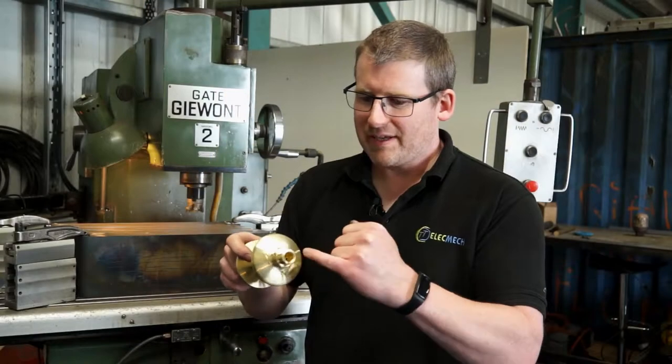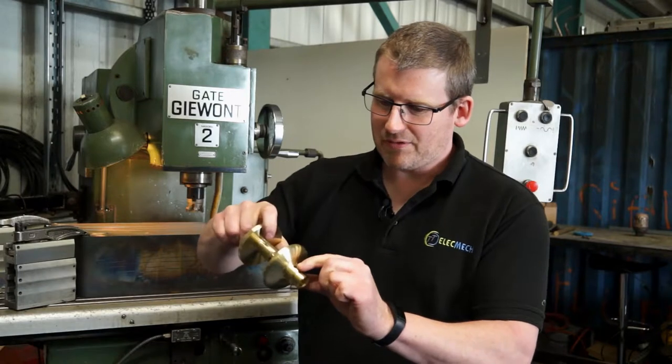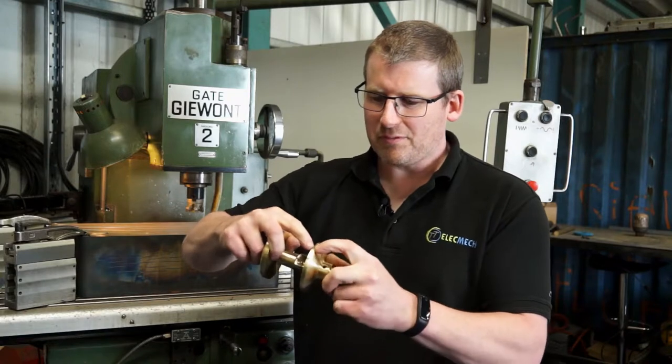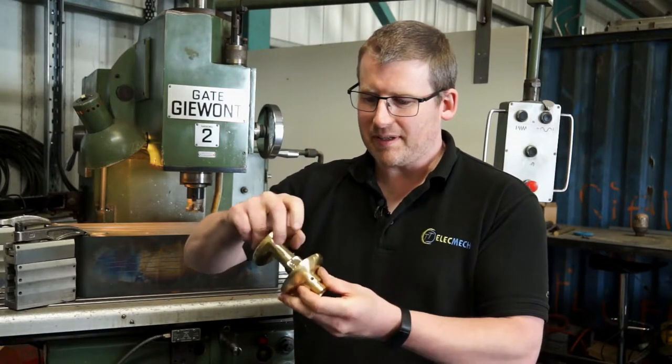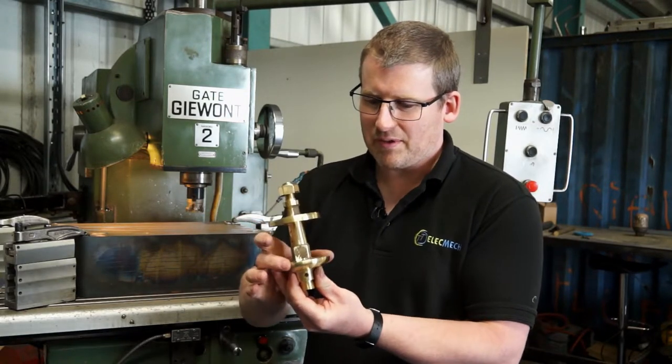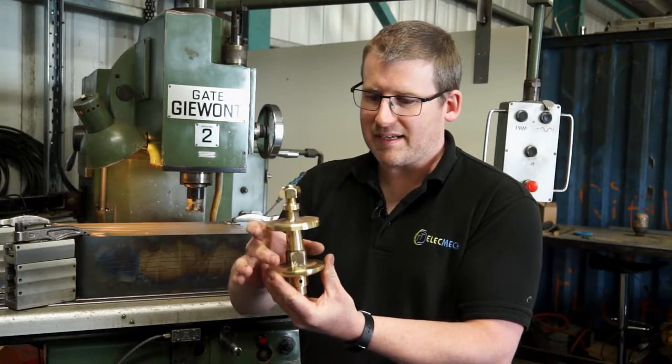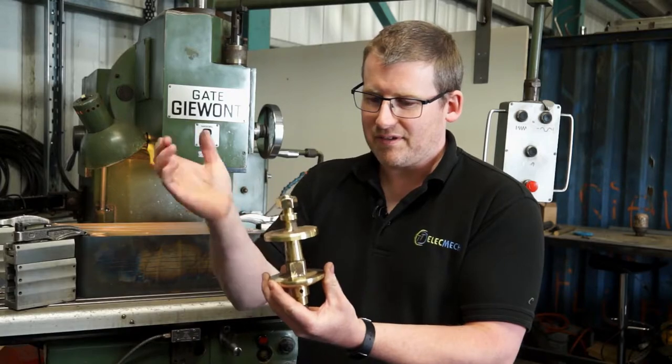We have a hole in the bottom. The air enters through the bottom, out through these holes on the side. It follows this radius around inside the cup. There's this very small parallel portion at the edge of the lid plate. It's squeezed up through a little gap and it'll hit the knife edge on the bottom of the bell, causing it to scream.